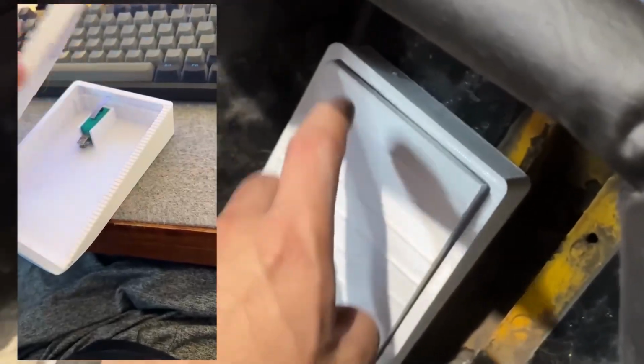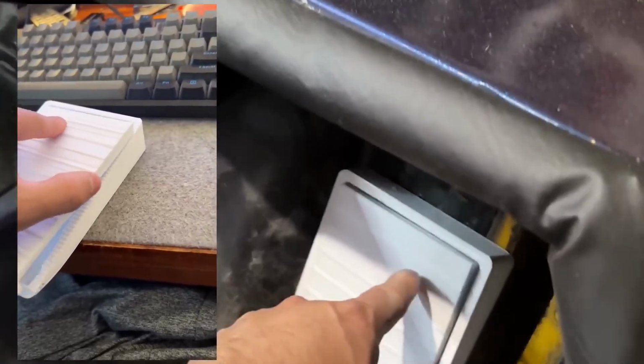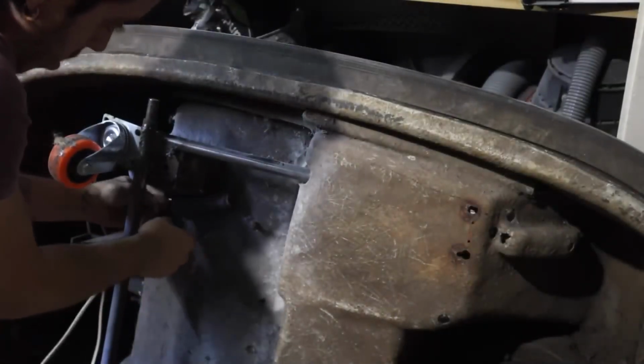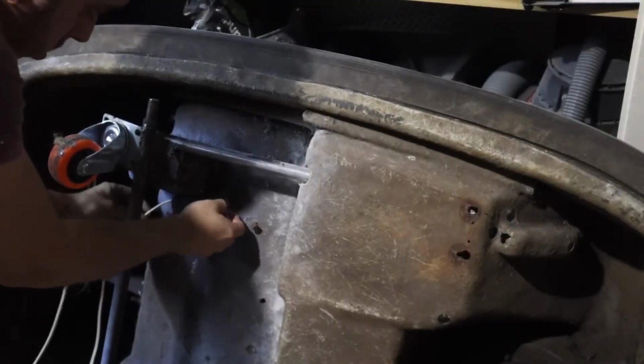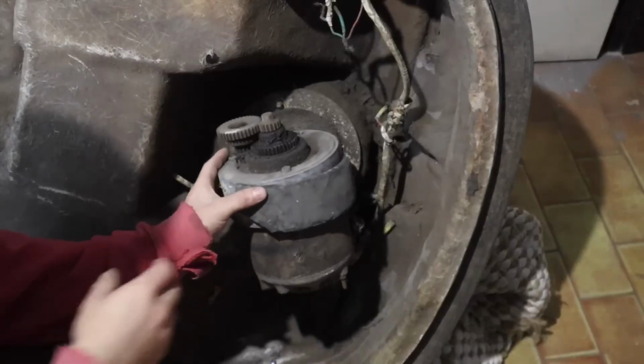Originally, I thought about using a brushed motor controller, but it didn't work very well. So I just printed a pretty basic throttle that basically pressed a switch. This switch activated a motorcycle relay that allowed the energy to go directly to the motor, and that's it. Basic, but effective.